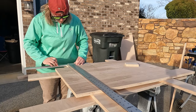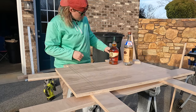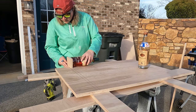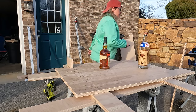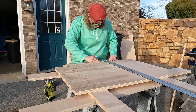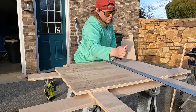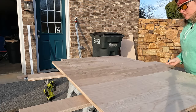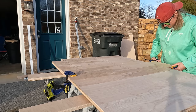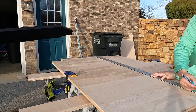Based on the plans that I created for this bar, I knew that I wanted to have a couple cabinets that would house a good amount of whiskey bottles. So I needed to figure out exactly where those shelves needed to sit in my cabinet. I took one of my cabinet side pieces and drew a line where the bottom shelf would sit, then took a couple of bottles to use as a guide to figure out how much clearance there would need to be. Once I had a good idea, I drew another line where my second shelf would go. Then I just took my opposing side piece, butted it up against the piece I'd already marked, making sure it was perfectly lined up, and transferred those lines to the other piece.